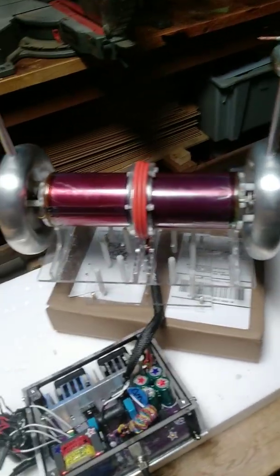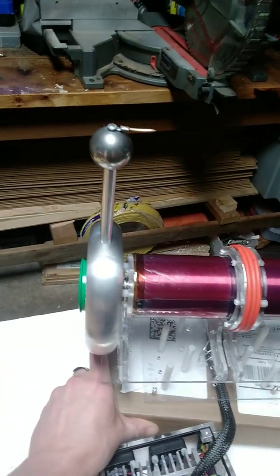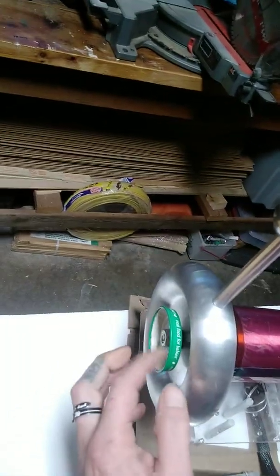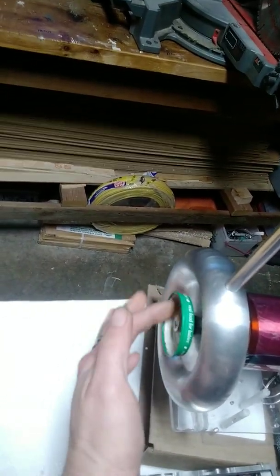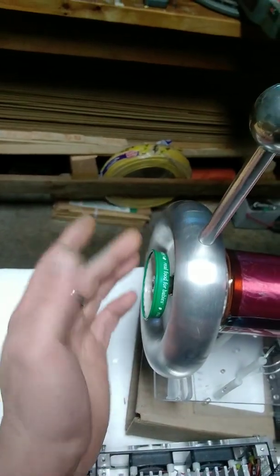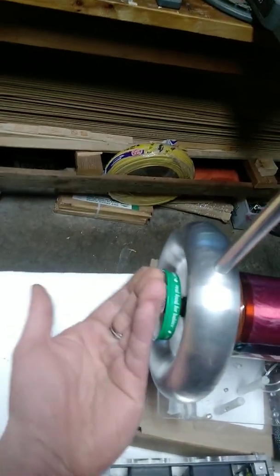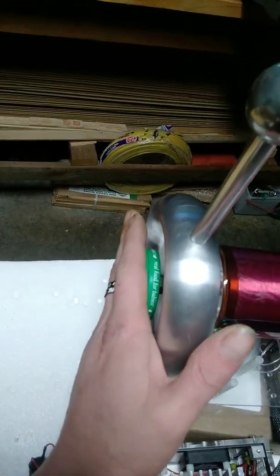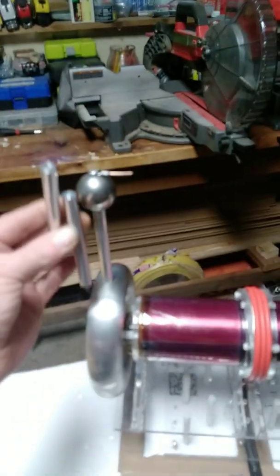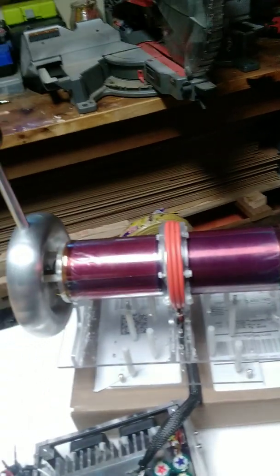I had to make a lot of adjustments as far as adjusting the capacitance, also known as the top load of the coil. This baby food lid is a plate; this toroid — this big donut shape is called a toroid. The gap between the baby food lid and the toroid actually adds capacitance — it acts just like a capacitor. There's one on each end, and I have other rods so I can make these balls higher or lower.